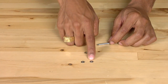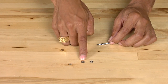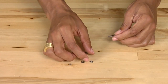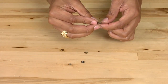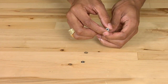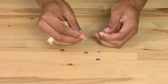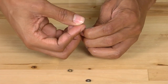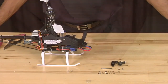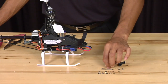The inner diameter of the inner race is actually a little bit larger than the inner diameter of the outer race. Without actually measuring the two, the easiest way to know which one goes on first is to simply slide one onto the spindle. If the race feels loose on the spindle, that is probably the inner race. To be 100% sure, take the other race and slide it onto the spindle as well — you can only get it on at the very top of the spindle; that is the outer race. Now that we know how to properly install the thrust bearing, we are going to reinstall the brand new spindle onto the helicopter.